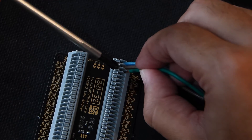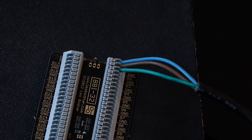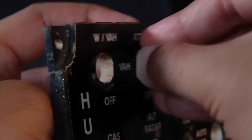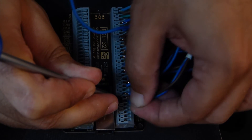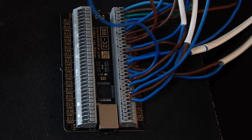We are going to connect the two inputs to the two button assignments, and only one ground connector will be used. So for an ON-OFF-ON switch, we will use three out of the four positions — button one, button two, and the ground connector for button one, leaving the button two ground connector free. Once you reach the end, you'll have something like this — a lot of connections and your panel with all of the switches connected.